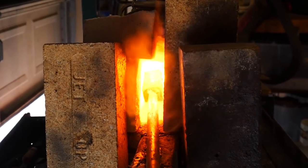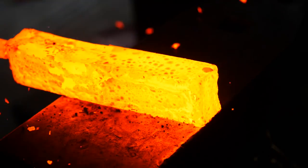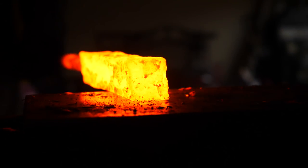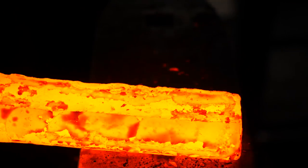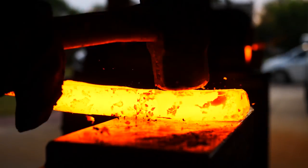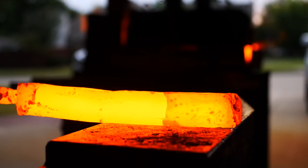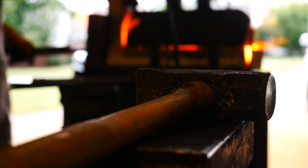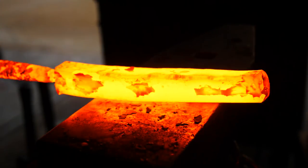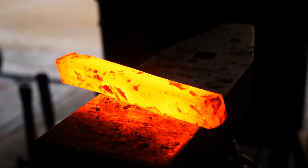The handle is welded — now we're off to forge welding. I marked which side of the handle I welded to the canister, indicating where the edge needs to be to keep the nickel out of the edge. That determines where I need to hit and strike and which dimension I need to flatten the canister most. The canister's not feeling very squishy under the hammer — that's a pretty good sign, perhaps we got a better fill than last time.